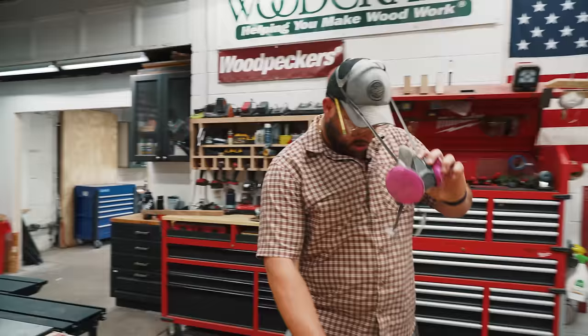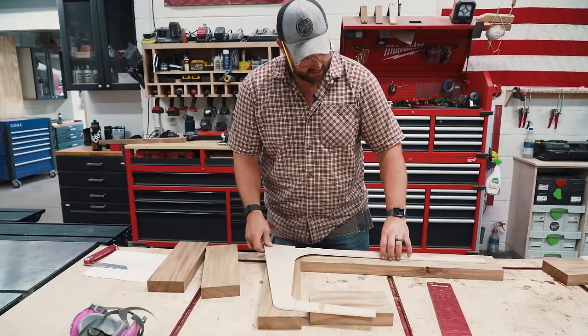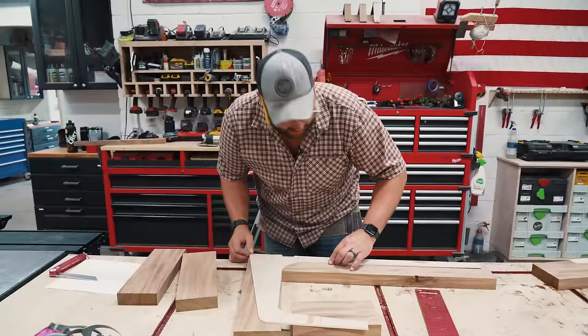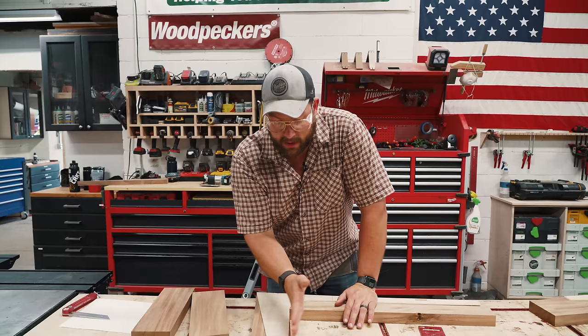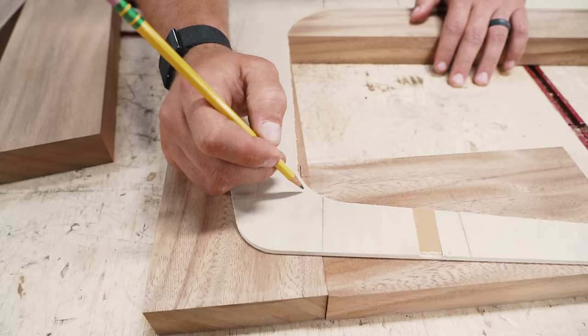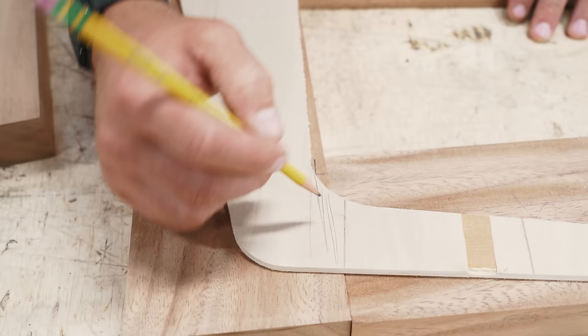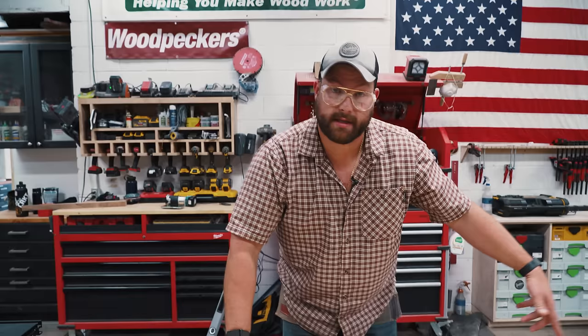We are laying out our parts now so we can domino these together. I cut a little bit of an angle so I can make everything fit. I don't have any precise measurements on this — I just kind of eyeball it and try to get as straight grain as I possibly can on the points that will support weight. One thing that's important here: we only have probably a quarter of an inch to maybe three eighths here in this distance. So the grain runs like this — if I was to come straight off of here it'd be a better joint for this arm here, that way it's complete straight grain and it's got a 90-degree mortise and tenon to add strength.